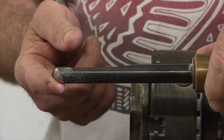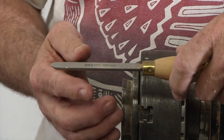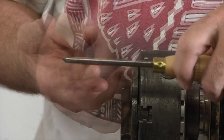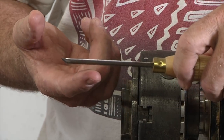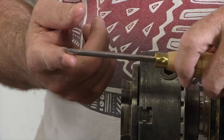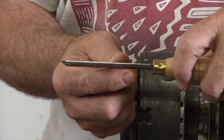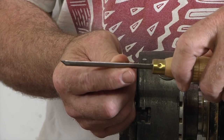Not so much a heavy-duty bowl tool. This is another similar type tool — this is a Sorby Spindlemaster. If you notice, this is not a half-round bar stock; it's a much smaller section. And with this steep bevel on here, this is definitely intended more for detail work or spindle-type work rather than working on bowls.